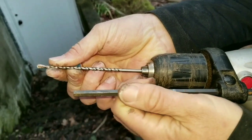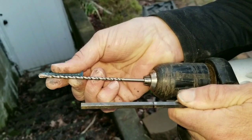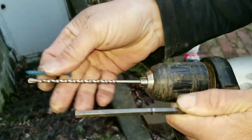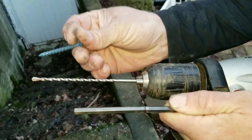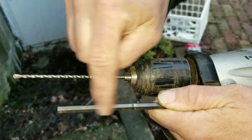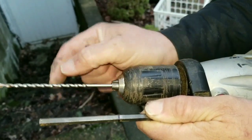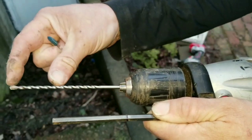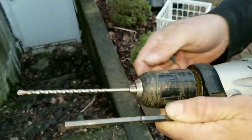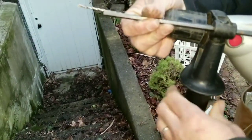All right, we're going to use this as the depth gauge, and I'm going to set it so it goes just a tad bit deeper than the depth of the screw, because the thickness of the metal we're going to fasten onto it is pretty thin. Another option if you don't have this guide is to just put a piece of tape — like white painters tape — around the bit, and then you stop at the tape. You can do that whether you're drilling in masonry or wood if you want a certain depth. That's a little trick. It's like what we did for the sewing machine when you have a wider hem or need a seam somewhere.